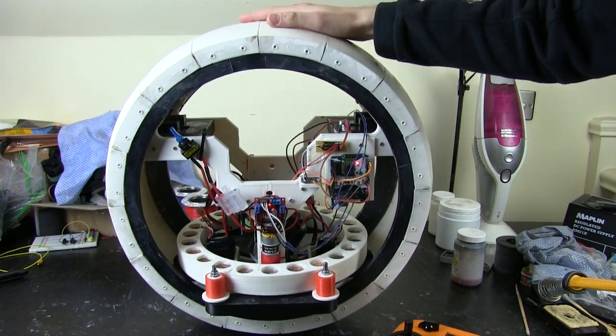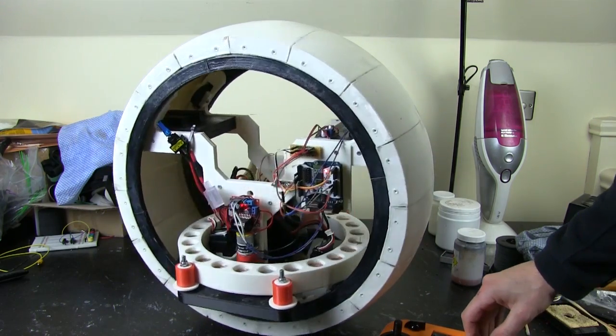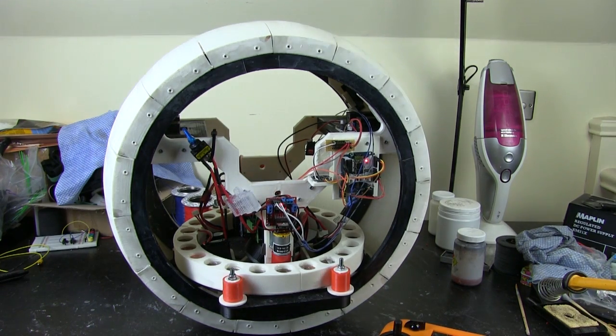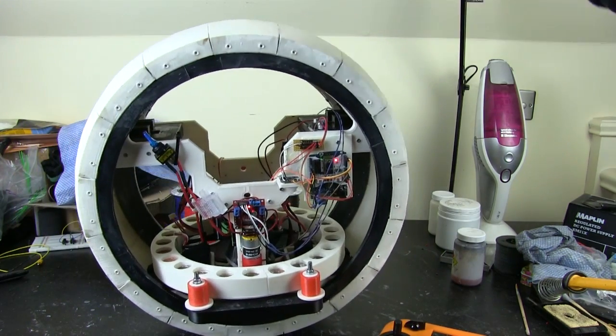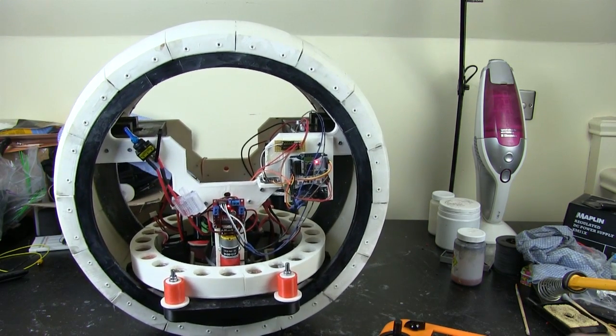Now there's a couple of dirty hacks. So I found that if I spin the lot of metal here, it really confuses the magnetometer part of the sensor and produces a bunch of data that isn't really there. So for a little while afterwards, it'll then drive off in one direction because it's affecting the angle it thinks it's at. So what I've actually done is locked out driving for 1.5 seconds after spinning this.